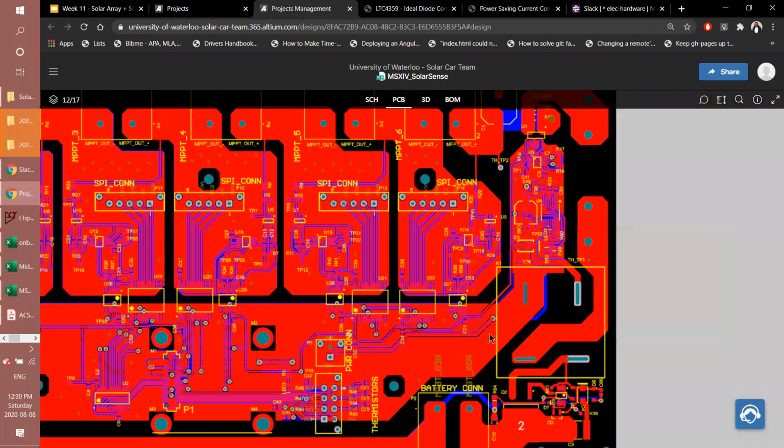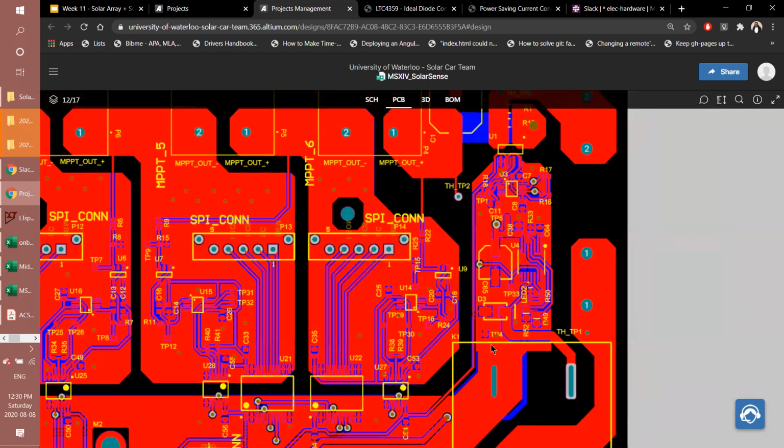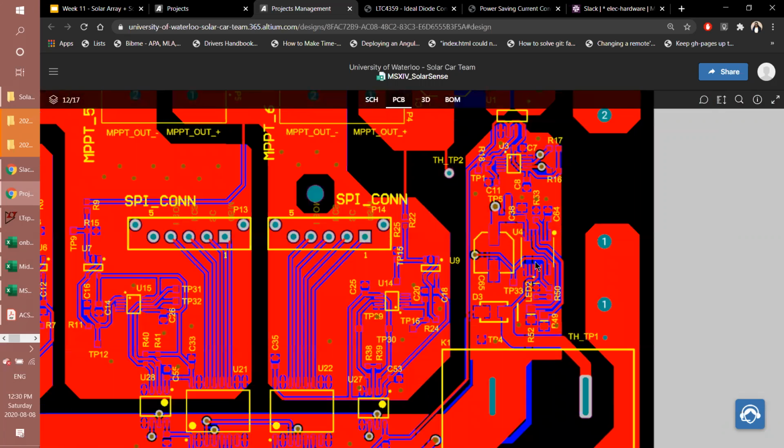But this interfacing is also carried out through the relay, because the contacts are part of the power path, but the coil is part of the same ground that extends from the digital communication, because we control the coil with ICs like the current driver that's referenced to this ground. So I had to continue the ground up here. It's kind of weird.